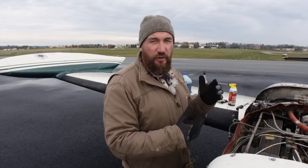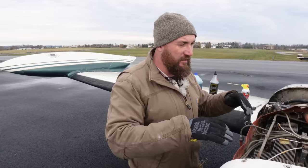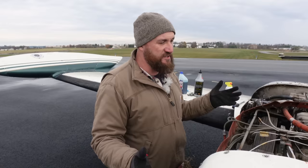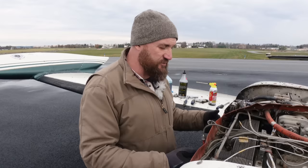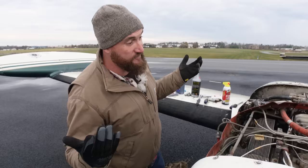These cylinders are very expensive, and although this engine hasn't run in a really long time, if these cylinders are in good condition they're worth a good amount of money. So we definitely don't want to go ruining anything. We'll scope them, we'll check them. You guys get to see exactly what it looks like inside there. One thing I didn't do — I didn't do what I probably should have done first, which was see if the engine had any oil in it.